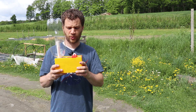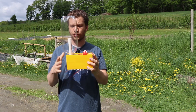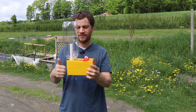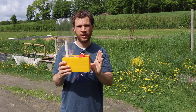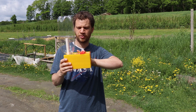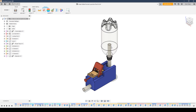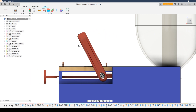I'm having a lot of problems with the release mechanism on this first design. The bottle is just not releasing. It works great when the bottle's empty, but as soon as I pressurize the bottle, it creates a lot of upward force which adds a lot of friction to the release mechanism, and it gets to the point where the mousetrap is just not strong enough to pull that locking fork free. So I went ahead and designed version two of this launcher. The goal with this second version is to get a lot more mechanical advantage out of the mousetrap to be able to pull harder on that locking fork.